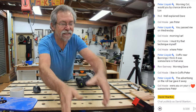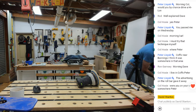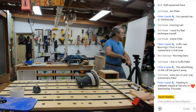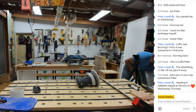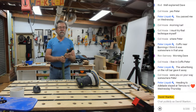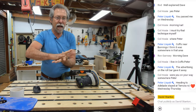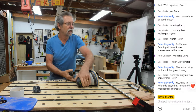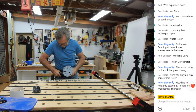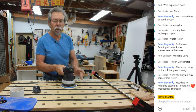Believe me. All right, the next thing I want to do also is I turn my dust extractor's suction speed all the way down. I'll turn it on. You can hear it start. I'll turn it on flat out to start. And now I'm going to turn it down. And that's so it's not sucking the sander up hard down on the surface and absolutely squishing it. Okay. Locked. This is going to make a little bit of noise, not a lot.